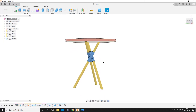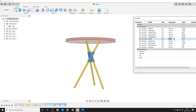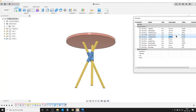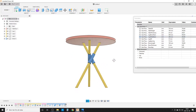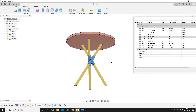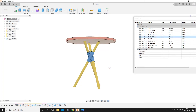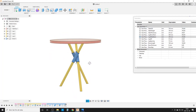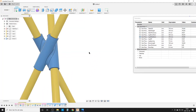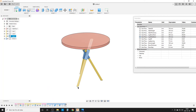By adjusting parameters I can move things around freely. I switch back to thinner legs at 27 millimeters — it updates everything. I think 33 millimeters actually looks better. I can also widen the legs at the table by changing the table diameter to 300 or even 350, which moves the brace connection points progressively lower toward the floor. Parameters let me explore the design quickly.